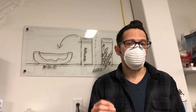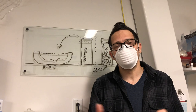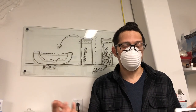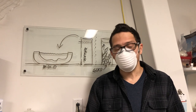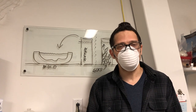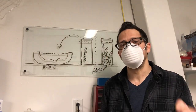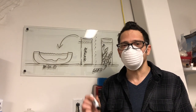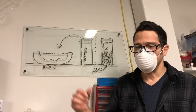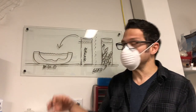Let's talk about how you figure the amount of glass — the volume of glass needed to fill your mold if you're going to do a glass casting. There are several ways to do this, but by far the simplest is displacement. Understand that displacement is a concept. There are many ways to do displacement and they all deal with volume. Basically, you are trading one volume for another — in this case, water.